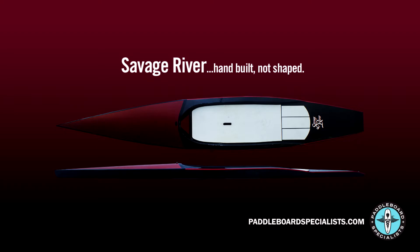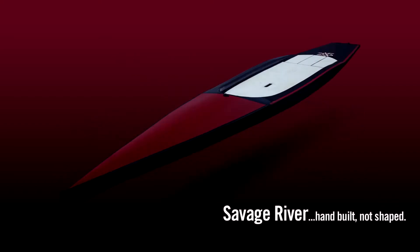This is a hollow construction. We do a hull and a deck, each built out of a mold, and then we put them together. It has a foam core and it's made out of carbon with some Kevlar reinforcing in it. This board here is about 24-25 pounds. The whole standing area is all foam core. We have stringers going down the center and also on the side where you're standing to make the two halves together so that it's stiff.